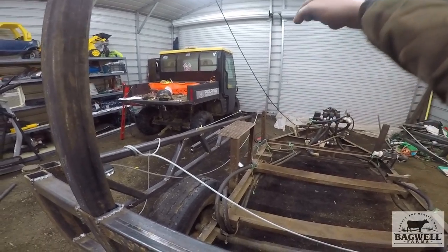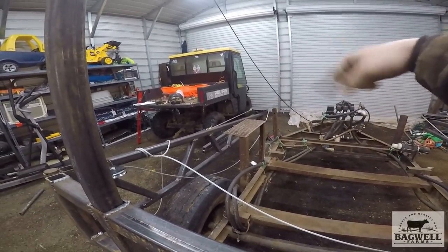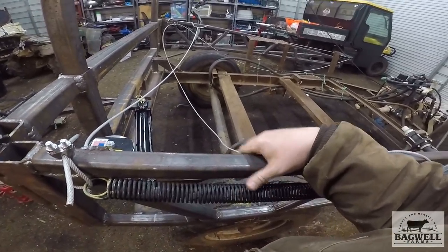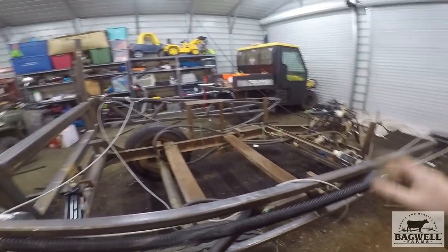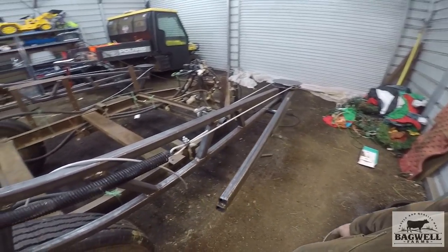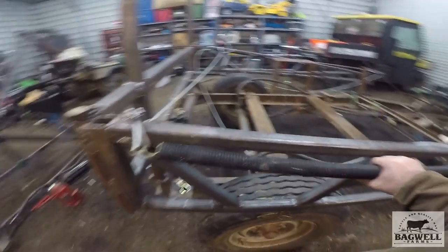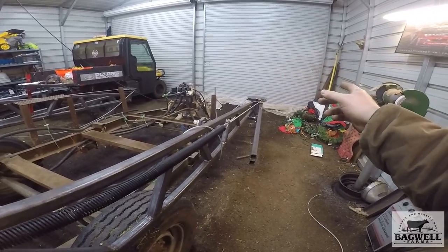That's how it's going to work. I mounted two pulleys right here and went to these discs I made that have a pin going down. The pin is welded to the hinges attached to the extensions - that's what makes it turn. The cable comes back up to these pulleys, goes across, and I've got d-rings or small ones wherever I decide these need to be mounted, and that's what will open these extensions up.